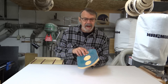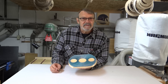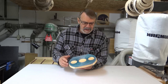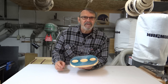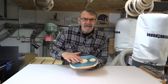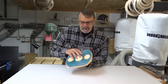Well, I hope you liked that. Maybe gave you an idea for one or two things. Trying to get that counterweight working and fine-tuned just right was a real challenge, but I enjoy doing it, just pretty much like anything I get a challenge on. The Varathane spray that I use left a bit of a pebbled finish, which I really liked on the beads, but I wasn't crazy about it in these little bowls, so I sanded those out to 600 grit, and then I used wipe-on poly on that and everything else on here.